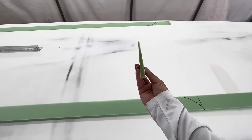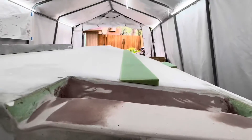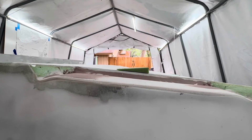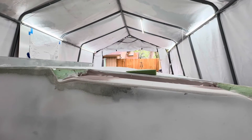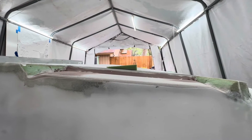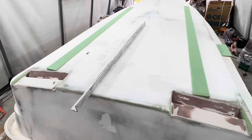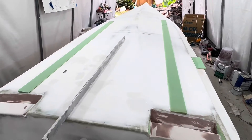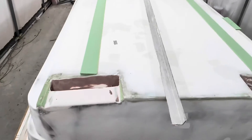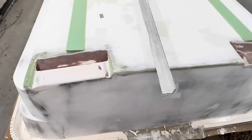I'm pretty excited about it - it's really coming together nicely. This is like a 10 degree lifting strake - it's nothing major, but just that little bit will do you a lot of good. You can see how it has a little bit of reverse chine - it kind of tilts in. It's not perfectly parallel with the running pad; instead it has a little bit of reverse chine, which I think is going to be really advantageous for a very stable boat. I'm about to glass these in, get my next strakes in, fare all that out, and do some more sanding. I'll probably put a guide coat on the whole hull, turn it black, come in with 120 grit then get it up to 180 and get it all ready for priming.